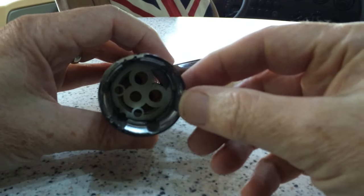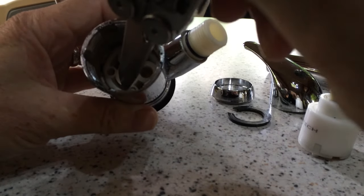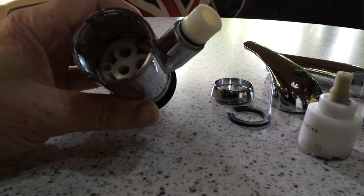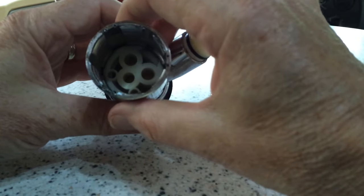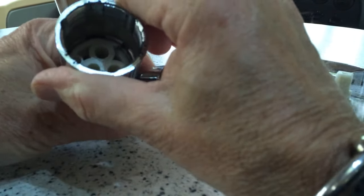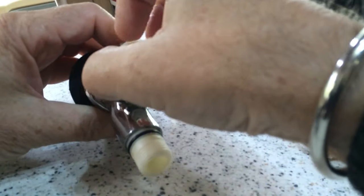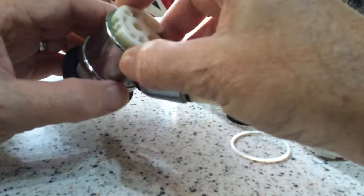If the body is cracked, you can probably remove it, though it's quite difficult. Inside there are two small grooves, each with a very small metal dowel. While those dowels are in place, it's impossible to unscrew the body. You need to prize them out with a very thin-nosed pair of pliers. Once they're out, you can unscrew the whole body. Underneath there's a little silicone washer which doesn't really provide a seal — it just makes the swivel part of the tap easier to move from side to side.